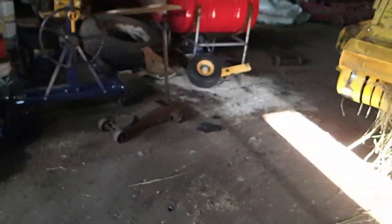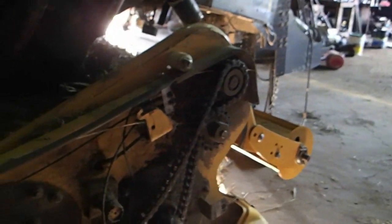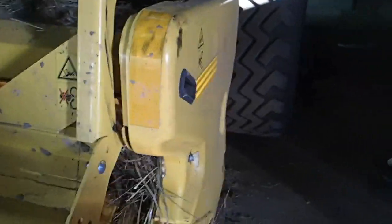The sprocket's fine. I'm just going to take that off and get that out of there. I just want to get this thing started, start getting it apart. It's pretty simple as far as dropping it — it's really just a couple of flanges. I'll pull this panel off and I'll be able to get in there and disconnect all these little plastic lines, and then I'll drop it away. Worst case scenario is I have to replace the whole header. Best case scenario is I don't have to replace the whole header, or I'll just be able to weld it back together. I've noticed this the last couple of weeks that there's a lot of flop going on there, and I don't like that at all.